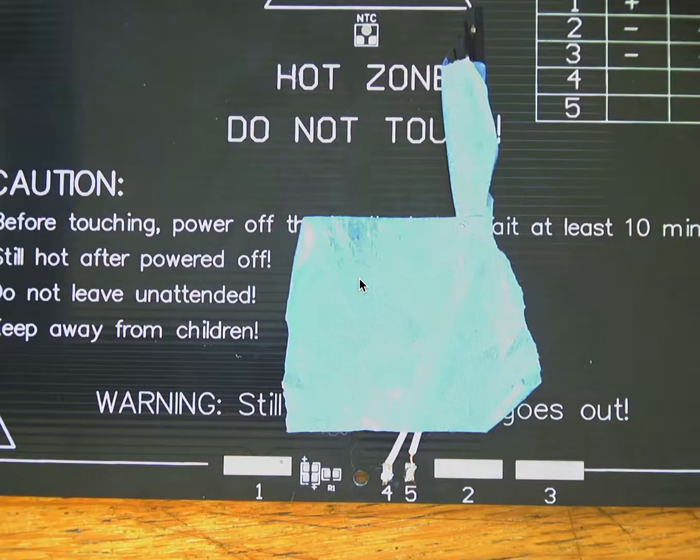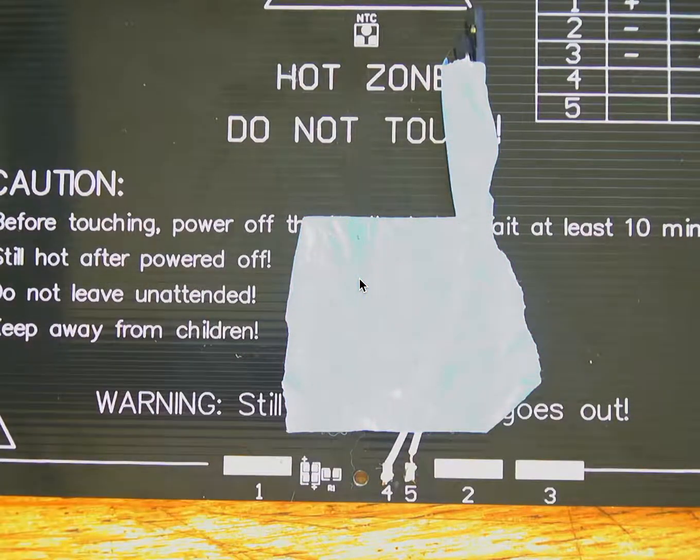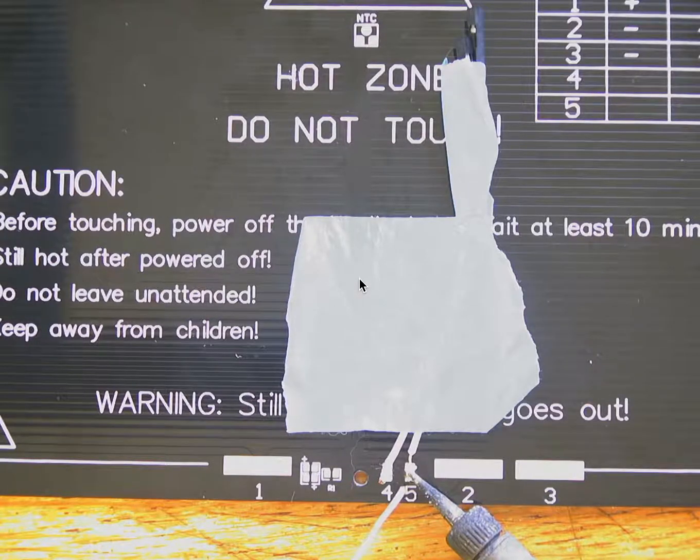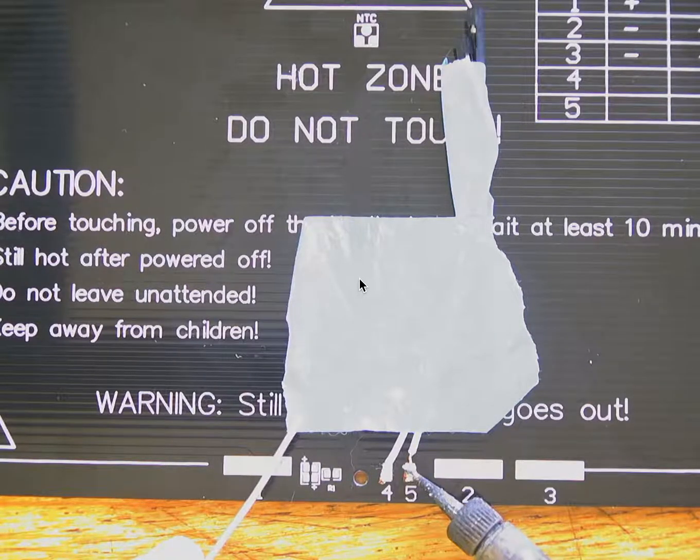It would be long wires going out from here, but I'm just doing this for simulation for wires that I'm not worried about. And then touch the wire and the tab and the solder all at once, most likely. Add solder if you need to, but hopefully get it heated up fairly quickly so you're not overheating anything, and get the wires stuck in place. My solder's melting.